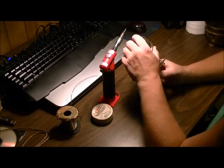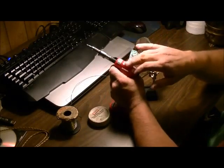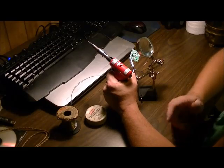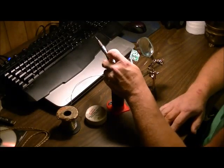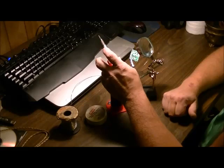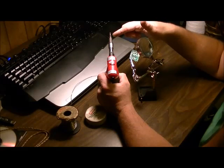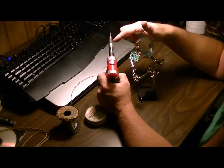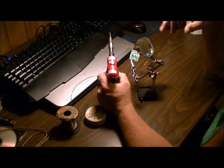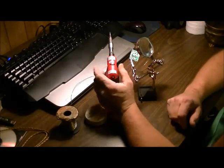Back to the helping hands — we've got it set up and our little magnifying glass set up so we can see where we're going. To use this soldering iron, make sure the vents are open at first. Start it up, push the lock button so it stays running, and count to about 15 or 20 seconds. You'll see it glowing red — it's heating up the tip. After about 20 seconds, close off the ports. This keeps it going and prevents it from overheating, because there's a little pack inside the heater unit that can't have a pure open-flame flow at it for too long.